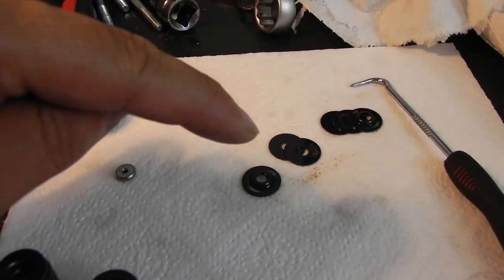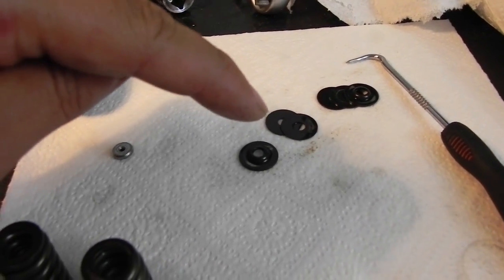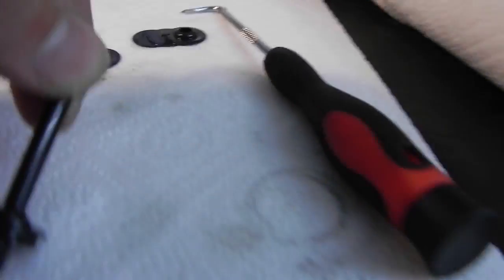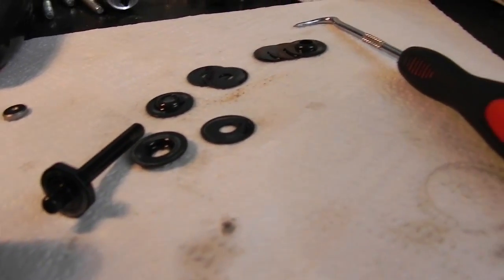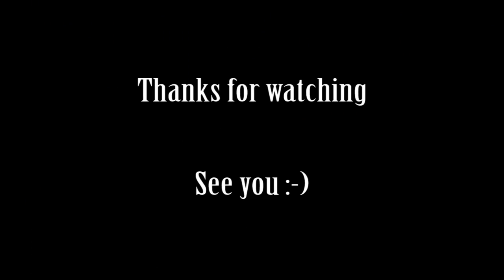The last strange thing I found is that on my pump there were two KF shims on the guiding pins for the springs, which is not the correct way to rebuild the pump according to Bosch's specification sheet. On the other pump there is only one KF shim on the spring guiding pin, and by measuring the shim thickness in my pump, there was double the shim thickness. Thanks for watching, see you guys.